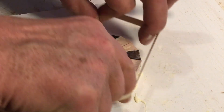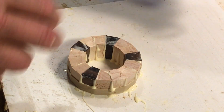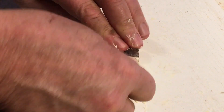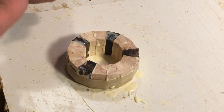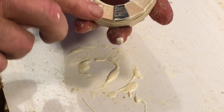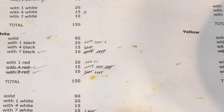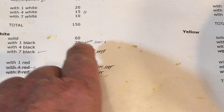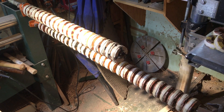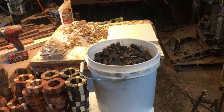I have perfect angles. I'm gluing these in one step, 15 segments at a time, using three or four rubber bands as pressure. This is a very tedious, laborious part of the project. I've created a gluing list — I need a total of 750 rings, 150 of each color, but they're mixed colors. This is very time consuming, a lot of labor, but it had to be done.